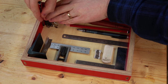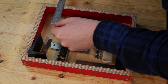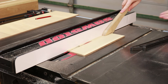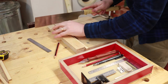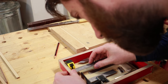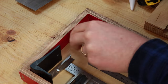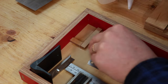I took some very rough measurements using the objects I wanted to store just so I could take that over to the table saw and get pieces that would roughly fit. I really only cut small thin strips of the 6mm plywood at the table saw, then used a hand saw to cut down the pieces — it's much safer that way than using the table saw or band saw. Because these won't see a lot of stress I just glued them in with some CA glue and activator.